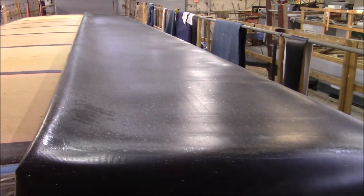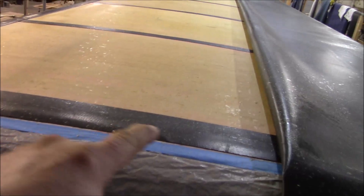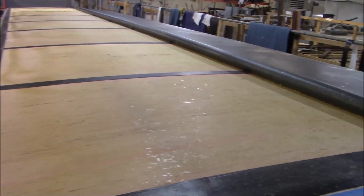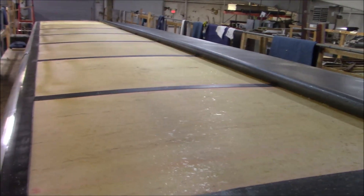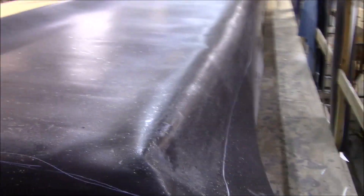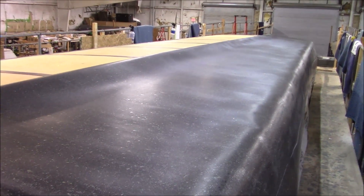The passenger side is already glued and put down. There's the driver's side — you can see all our buffer strips and protective strips. On a coach like this we didn't really need them, but they put them on anyway. We built new shoulders all the way down on both sides. Now we're going to roll this out, go over it with the heavy roller, then start putting in the curbs and getting everything together. This was a pretty straightforward roof — it's a relief to get one we can come in, do minor repairs, and get out.